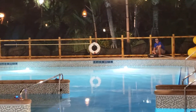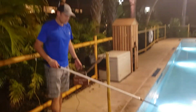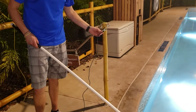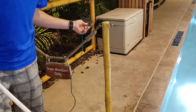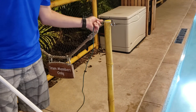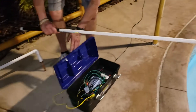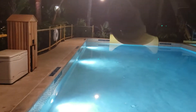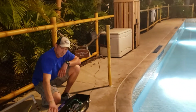Now we'll come to the other side of the pool. We're on the other corner of the pool and we're going to show you what we're doing with our battery powered test probe. Now we're going to hook it to a known earth ground source. We have a battery powered Dock Lifeguard hooked to earth ground, and a test probe hooked to earth ground. We're going to momentarily put electricity in the water and you can see the Dock Lifeguard alarming.